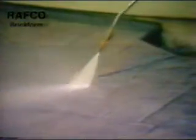The pressure washing will remove as much of the residue from the release agent as is required to expose the desired color effect. The variation in colors or shades of color will highlight the texture of the embossed concrete.